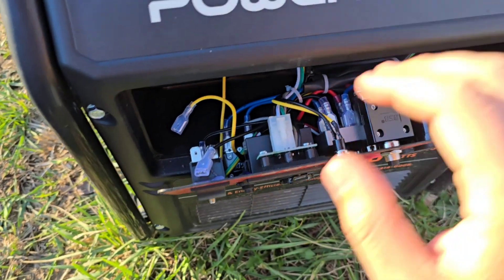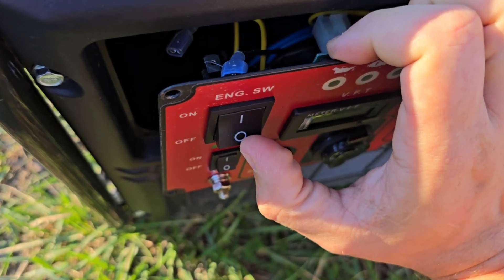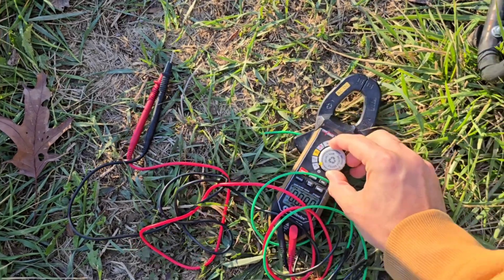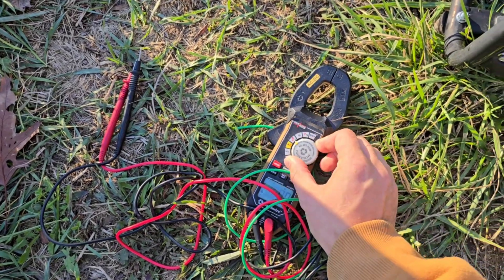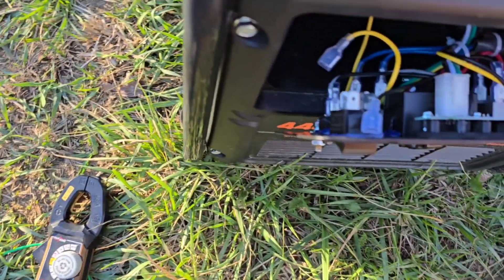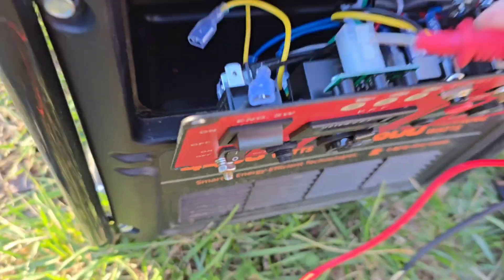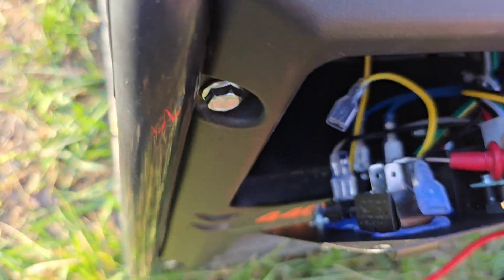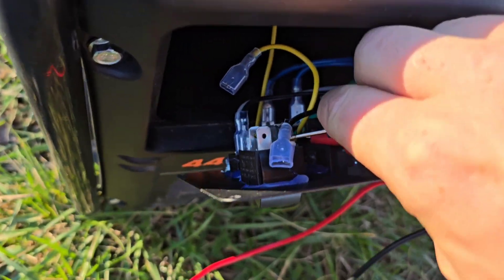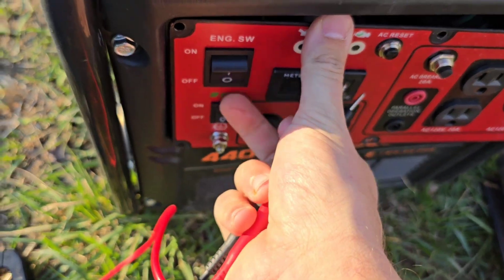It's a Torx C512HH, and I've already got the front panel pulled off of our generator. We've got an engine switch here just like on any generator — it has on and off; off kills the engine. You can take a digital multimeter, set it to ohms continuity, so that when the probes touch together it beeps. We've got it set to off, and both pins on this switch are shorted out when it's set to off — that's the signal it's sending to the coil. Most generators just short out the coil.